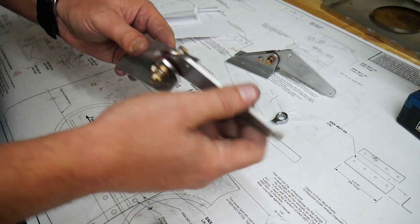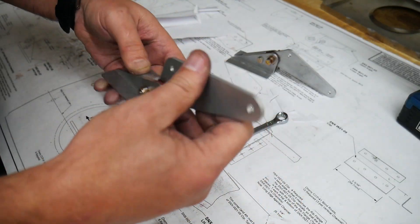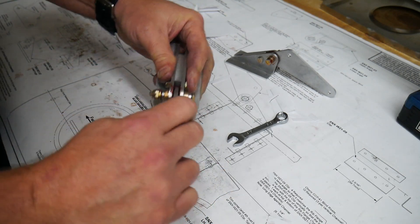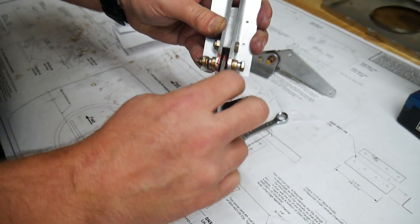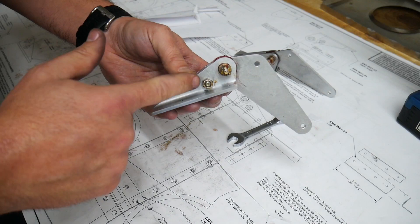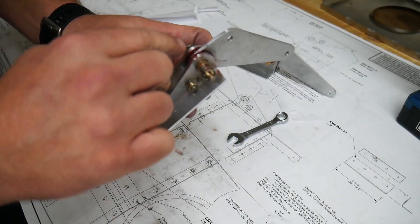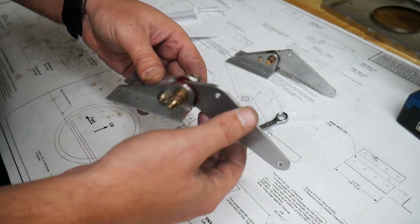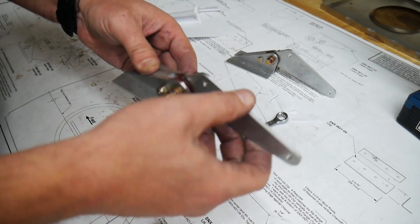It's got just a little tiny bit of drag on it and moves fairly freely. I don't have any side-to-side motion at all really. It feels actually really snug in there. So I'm going to replace the nut, put a little bit more grease in along the bearings and the bell crank, and reassemble it all with a brand-new nut to keep everything in place. It feels pretty good.